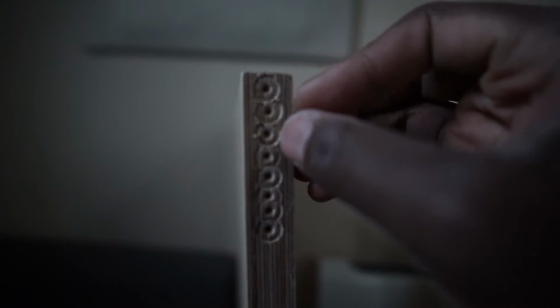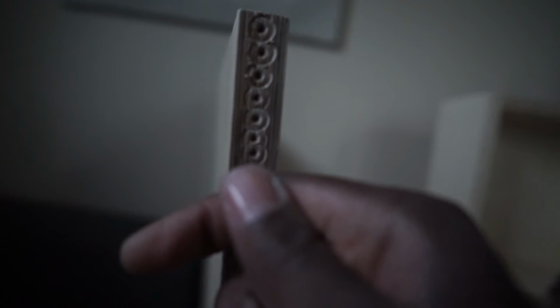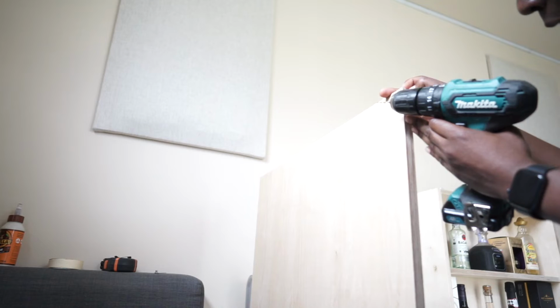So hopefully that comes out. As you can see, I've now done that, so I'll get my chisel and take out the lines and straighten it up outside as well, and then I can start edging it out, and at least I've got my depth. It needs to be a couple of mils, so I'm going to take it in a bit more, but it's just an easier way of getting it down, because if I got my chisel, I'm not that great with it, and I know what would happen. I would hack into it too much, or start chipping at the sides. So this is a much easier way of me doing it, and I can just tidy it up with the chisel as I go along.